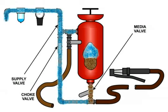A good example would be for shading, you might only want a whisper of airflow with very little abrasive. For carving, the preference would be a higher airflow with more abrasive. It's pretty easy to understand too little abrasive flow, no work gets done. Too much abrasive causes the grit to fight against itself.